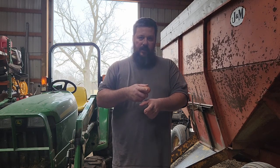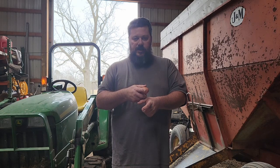And then I'll go through and I'll start at the first place I can ground it, which for me is a metal T-post, see what kind of arc I got. Go to the next one, see what kind of arc I got. And I'll keep going down. It's gonna be pretty consistent, but once you move past the short, you won't get hardly anything because the electricity is coming through and it's using up the majority of the voltage right there. So it's dropping the load across that short. You don't get a whole lot afterwards. I know at that point I go back and I can find the short easier that way.